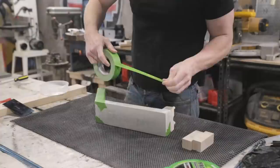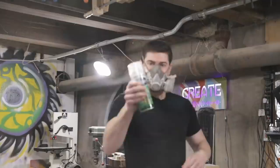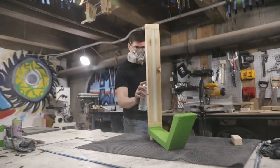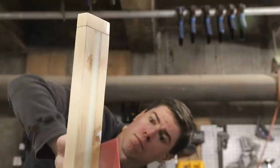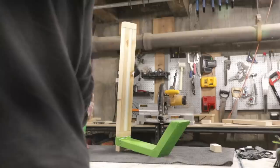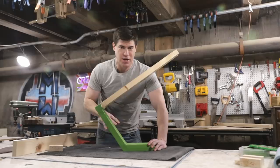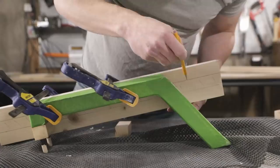It was time to finish the wood. An easy way to spray coat it was to put the wood right onto the concrete base, so I covered the concrete with painter's tape to protect it. I ended up doing six coats of spray lacquer, sanding with fine grit sanding pads between each coat. I knew I was cutting it close with the stability of this lamp as far as weight distribution goes — and the design would sometimes tip over — so I'm going to modify the design slightly and cut a triangular piece of 2x4 to slot in the back and give it support.